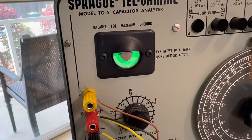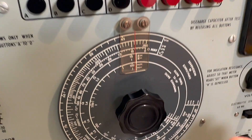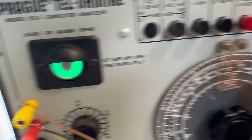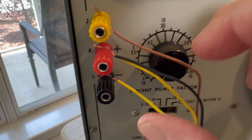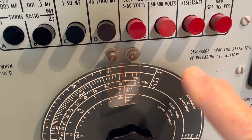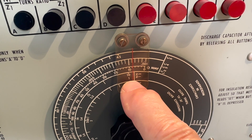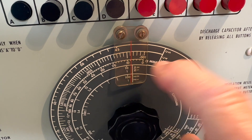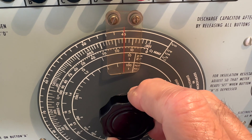Now I had to do that. At first I was rotating it and I was getting no reading at all. So you can reverse either the black and brown or the yellow — doesn't matter, just reverse one if it doesn't work. So you can see we've got the N1 and N2. We're on N1, so that bottom ring there is the number that we're looking at.